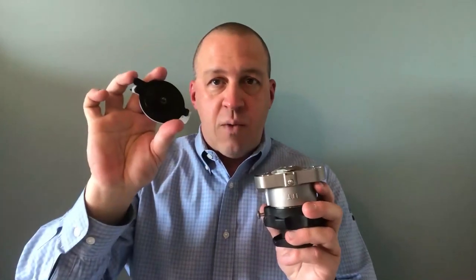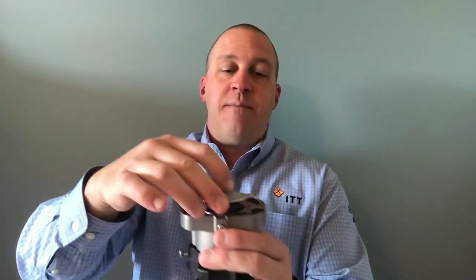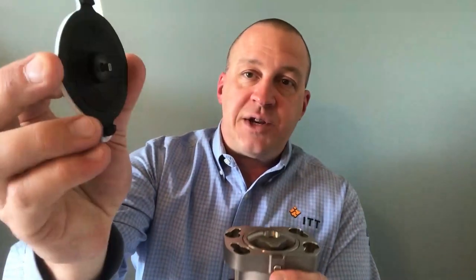You may have to use air intermittently to get to the different positions. Just know that you're probably going to want to have supply air or some type of local air to that actuator to be able to do the changeout. So at this point, we've got our diaphragm removed. We take our old diaphragm and dispose of it, then grab our new diaphragm and start doing the steps in reverse. Drop the new diaphragm on — there's a clipped head stud on there that's going to marry to the slot on the compressor. Drop it in, give it a quarter-turn, and line up the tab of the diaphragm with the cut-out tab in the bonnet.